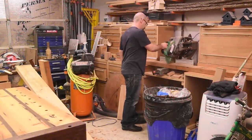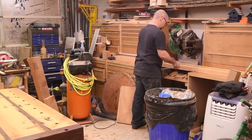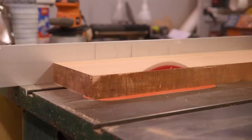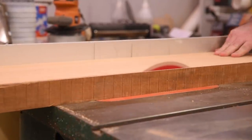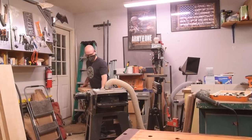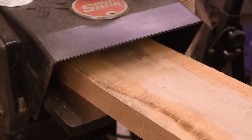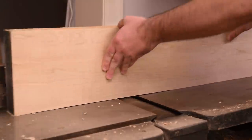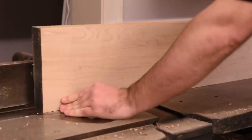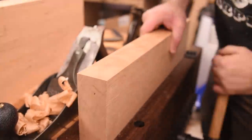Like most of my hardwood projects, this one started with breaking down the material to rough lengths and milling the material. I did a video on my milling process that I'll link below, but the short of it is I'm making the wood flat, square, and straight. I'm using a lot of big machines to speed things up, but you don't need them. Last summer I did a series on machine substitutions. And as far as milling goes, you can also just buy S4S lumber, which is wood that has already been milled for you. The joinery for this can be done with just three tools, and we'll get into that later.